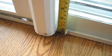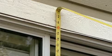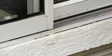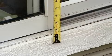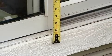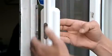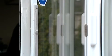For interior mounted screens, the height measurement will generally be from the floor to the top inside of the door frame, less 1/8 of an inch for clearance. For exterior mounted screens, the measurements may be similar. However, if the screen mounts to the trim framing the door, measure 1 inch past the edges of the trim to allow for the screen's tracks to be mounted. Be sure that the screen and tracks location will not interfere or damage any window treatments such as blinds and curtains or the glass in the patio door.